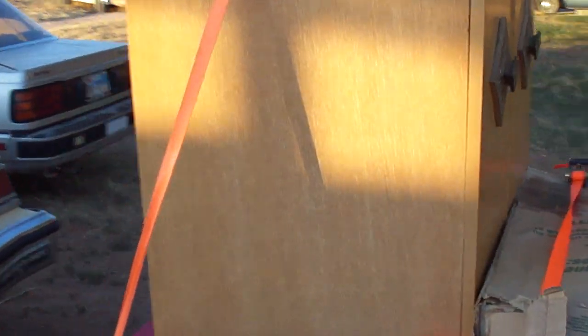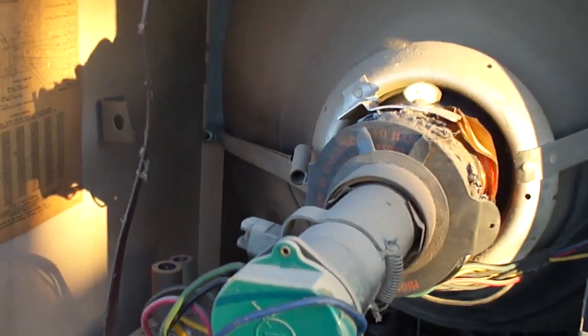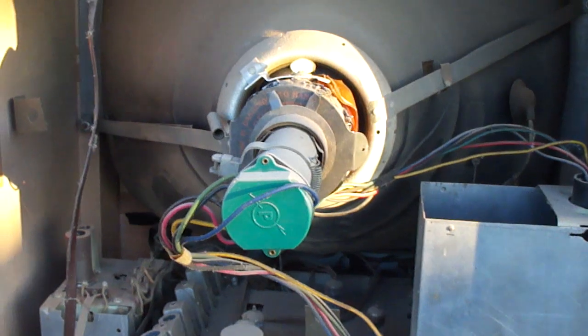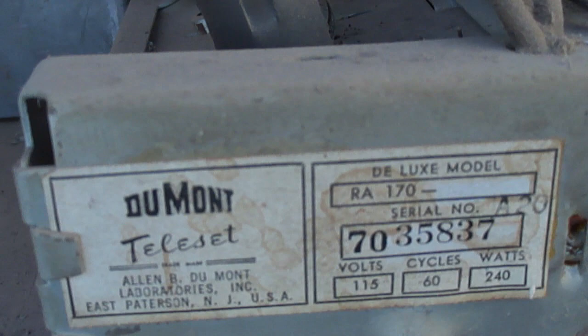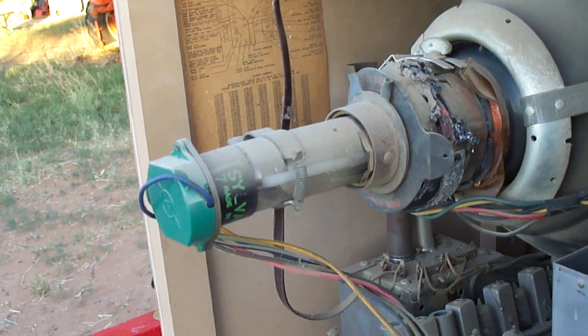I don't want to have to rig down the ratchet straps now, but this is a real long CRT. I don't know if this is 70 degree angle or what. It's a Dumont Teleset, model RA170. So I'm going to put the CRT tester on this and just see if it has a working CRT — it's a Sylvania so maybe it's been a replacement. It might need rejuvenating. Then I have to get the chassis out and start replacing caps.